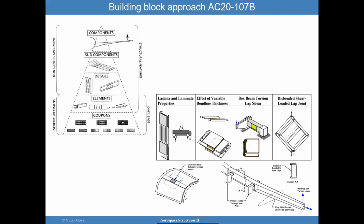And so going back here, the FAA, in the aerospace industry, we really rely on the building block approach to really get you to be successful. And so that's when I talk about 180 coupons, yes, at this level, 180 coupons. But once you gain that confidence in your analysis inputs, you can start testing less and less with larger panels or more complicated features until you go to your full-scale test, your qualification testing.